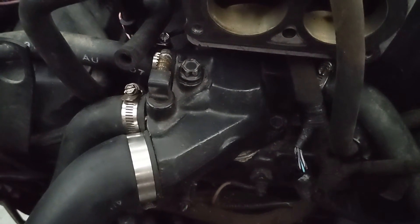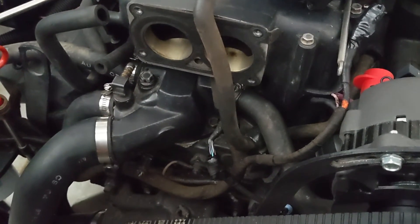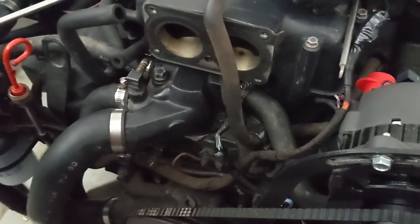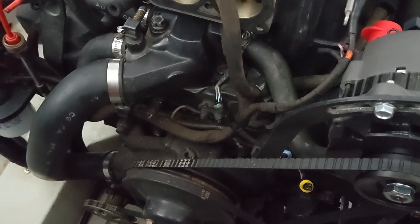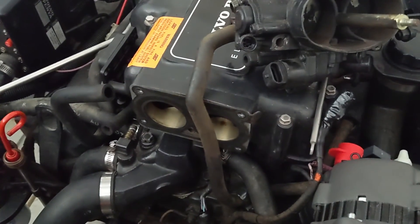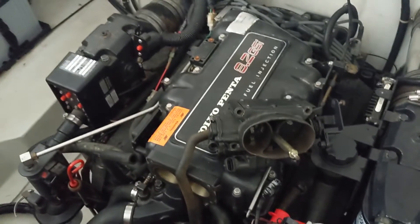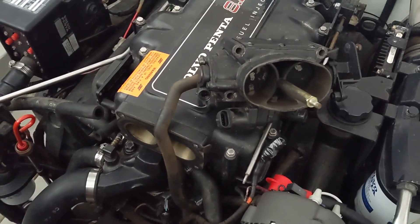While we were here I went ahead and pulled off the hose for the steering cooler — which is back there, difficult to see — just to make sure there are no bits of the impeller that ended up in there. We're all good and clean. During this process I flushed out all the hoses, just back-flushed everything, so we should be good as far as any rubber bits from the impeller that may have made their way through. We're gonna get the stainless steel hose clamp on, get the throttle body back on, and then we should be good to go. Hope you enjoyed this video and found it helpful — leave any questions in the comments below, like, share, and subscribe.